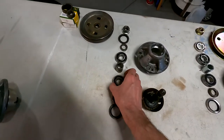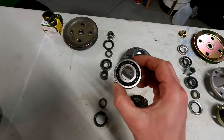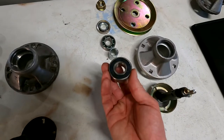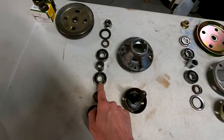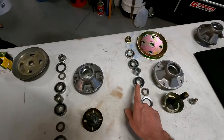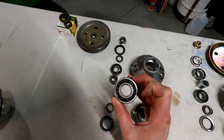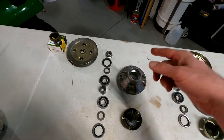Here's the truth about bearings: this John Deere bearing, I looked it up — it's a $20 bearing. It is a 6204C4. The aftermarket one is also a 6204, but it's got the suffix 2RS — two radial seals. There's also a clearance specification. The John Deere is a C4, and the aftermarket is likely a C3. The C3 has tighter clearances, but the C4 is actually better for this application: with wider clearances, it can tolerate more heat and is better for a grease-packed application. Spindle bearings spin really fast, get really hot, and are packed with grease — so you want a C4.